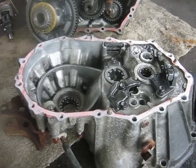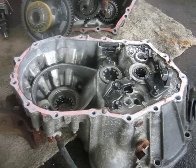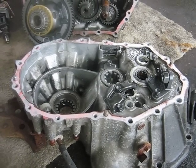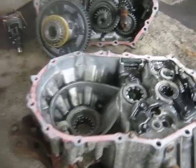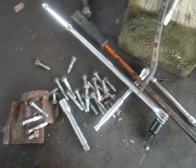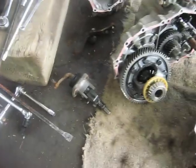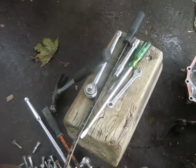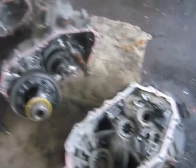Here I've taken apart the five-speed manual transmission from an 88 to 92 front-wheel drive Toyota Corolla. After the removal of quite a pile of bolts — it's basically zippered together with bolts — you can see all the tools I've used here, mainly sockets, a hammer, and a couple of pry bars. I'll go through the sequence I used.